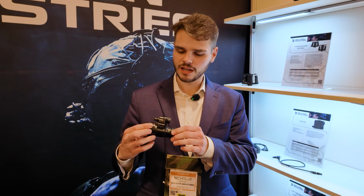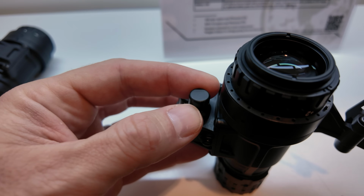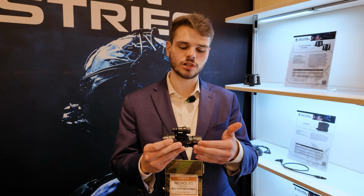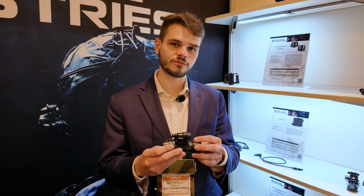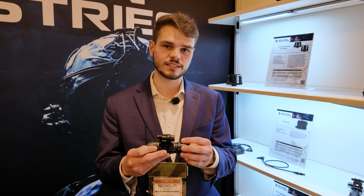What I have here is the 7075 Talon R. Basically, single control scheme. This does your power, your gain control, and your IR illuminator. On board, we also have indicators for both your illuminator and your low battery. It's a standard plug-in EGAC for a 11769 image intensifier. We also have a through via for a solderable third middle pin for European-style 11769 tubes.